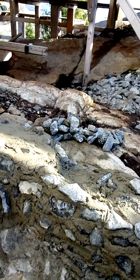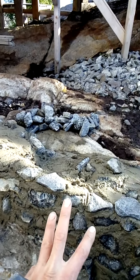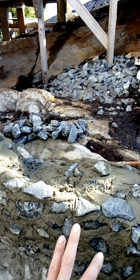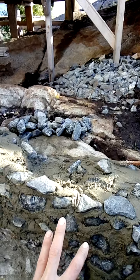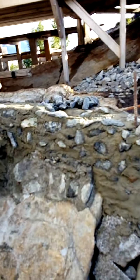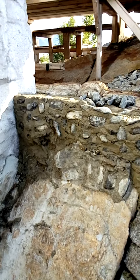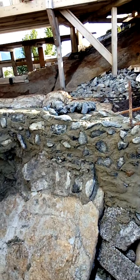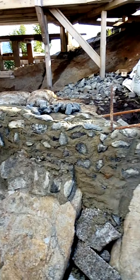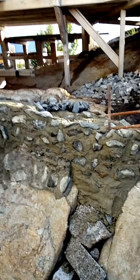This takes quite a lot of time, but I've saved on concrete and only used three bags, which are 25 kilos each. In dry weight that's 12 and a half liters, so about 38 to 39 liters of concrete total — and you can see this is definitely more than that volume in wall. This little patch alone has taken me four or five hours.